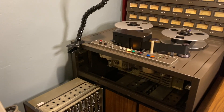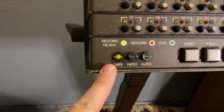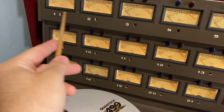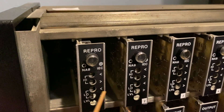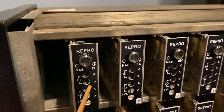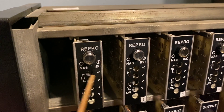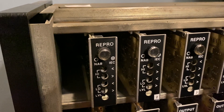Channel 1 through 8 — we just did the level. Now I've gotten to a spot where I'm at the 10k tone. I'm in tape, so I'm going to play the 10k tone and see where our levels are. Then I come down here to the repro card. We're not doing low — that's 15 ips — we're doing 30 ips right here. And 10k high right here. We're going to adjust the very top potentiometer to 0, because we're calibrating for 10 kHz.